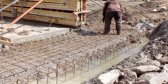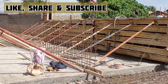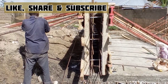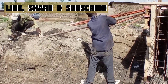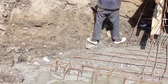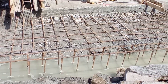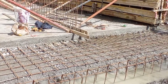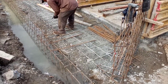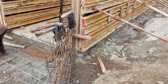The main purpose of placing this toe beam and apron is to protect our culvert, since the water is going to be entering into the culvert at a very high pressure and the volume of water will also be high. This is the reason why it is always advised to construct a toe beam and apron to protect our culvert. The projection of this apron is maintained at 1.5 meters — you may also extend it to 2 meters.